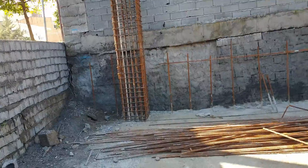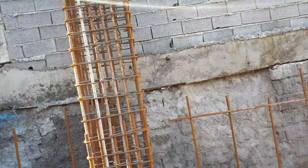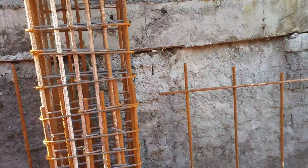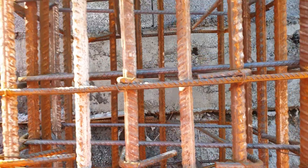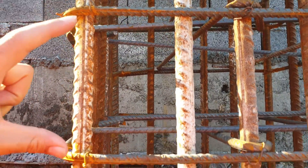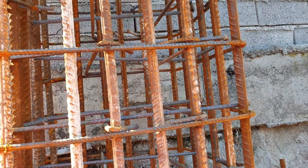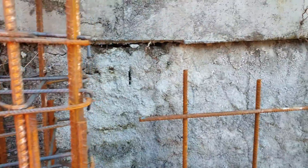These are another column in the stage of formwork. The space between two stirrups is okay in the middle of the column. But we know that the spacing of stirrups in the critical zone should be more tight — should be less.